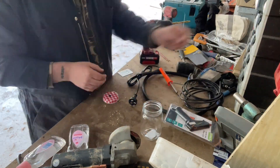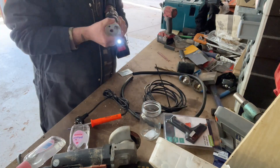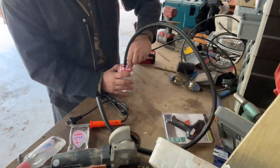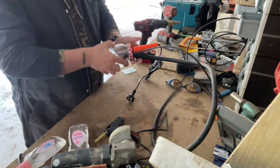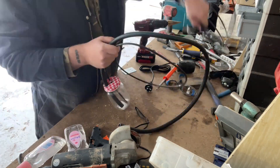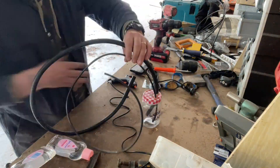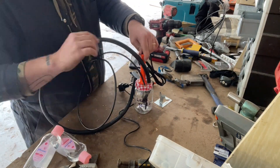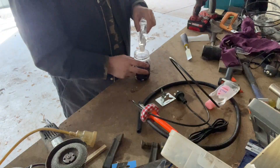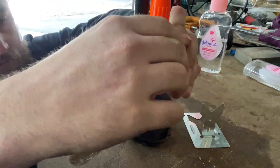I am going to make a correction to this video — the hot glue gun doesn't work unfortunately. The soldering iron heats it up a little too much and remelts all the hot glue, which then breaks all the seals. Don't use that — I would suggest using epoxy, that's what I'm going to rebuild mine with. Probably use bigger hose as well. Those are the only two corrections, but it was a first time and just what I had around the house.